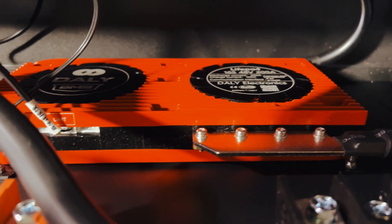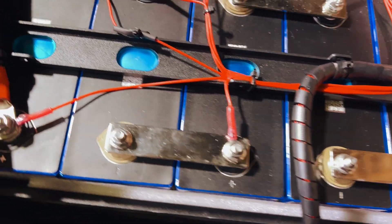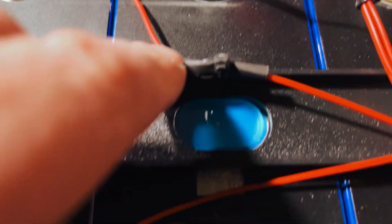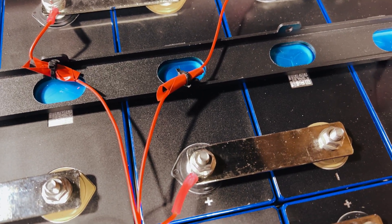For negative power, the BMS comes to the main negative terminal, through the BMS, then into the switch on this side and out of the switch along to the terminal. We've torqued all of these down and double and triple checked everything. Cable tied where we can to keep things from being loose. We've protected the balance lead with a sheath because we've cable tied it to a metal chassis, and everywhere we've put protection on them so they shouldn't ever wear through.